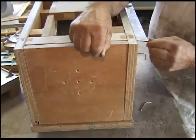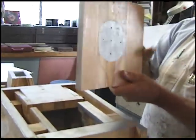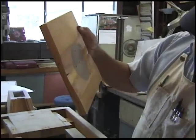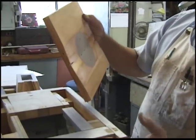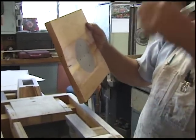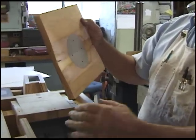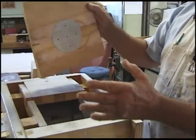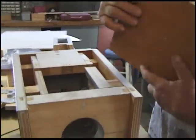Can we take a look at the angle on this before you put it in? Just up from the side so we can see, because you can't see it. That angle there? Yeah, the reverse. That's great, to match the taper on the outside. It's just drafted, but it has to be the angle so that the pattern pulls out of the sand. And also we want the core to match it, because when it goes down, it positions that core front and back, so it stays put.